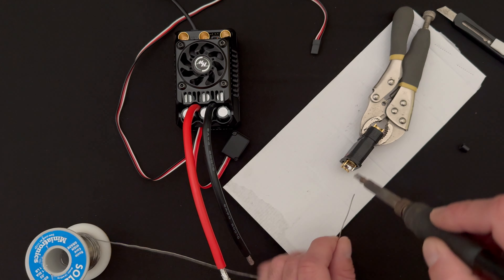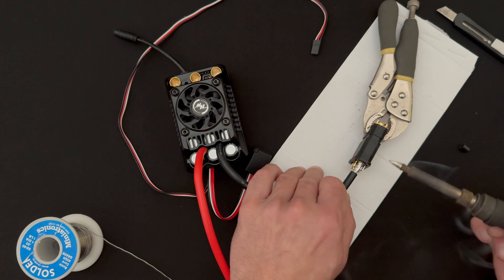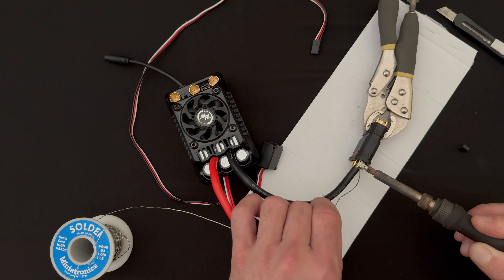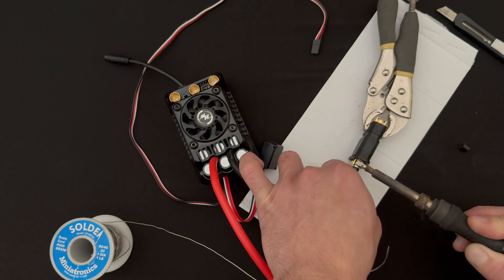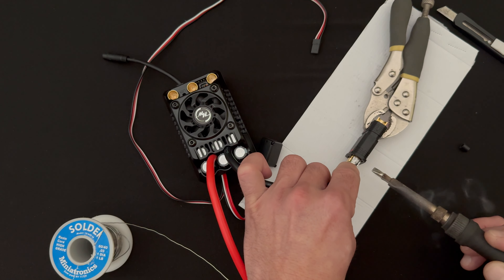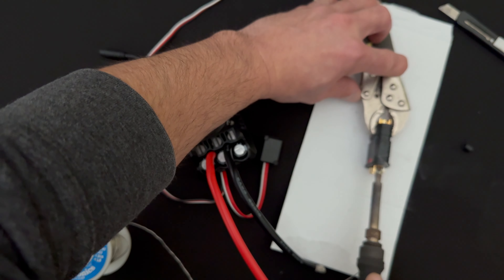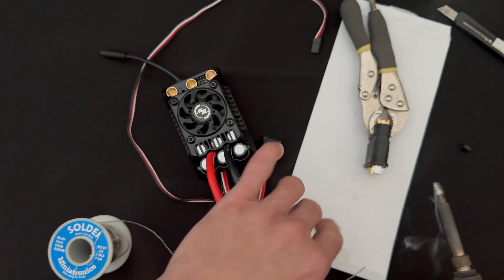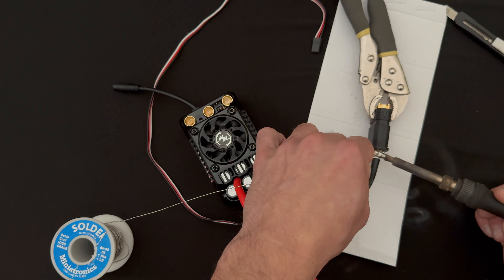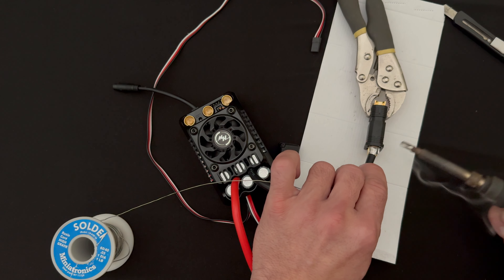I'm going to tin the cup down first, then lay the wire in with a little bit of pressure and a touch more solder on top. The idea is you want to get all the solder to flow so that the wire pushes down through the solder onto the surface of the plug itself. These are big power wires and they don't want to flow solder easily, so there's some work involved to get the wire all the way seated.